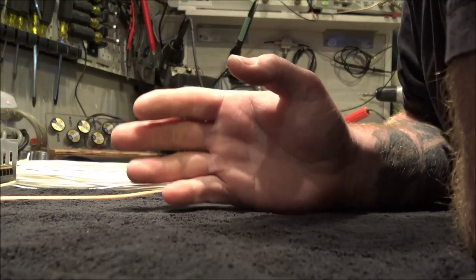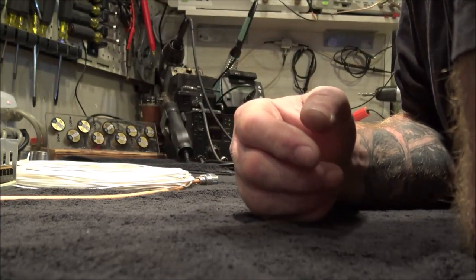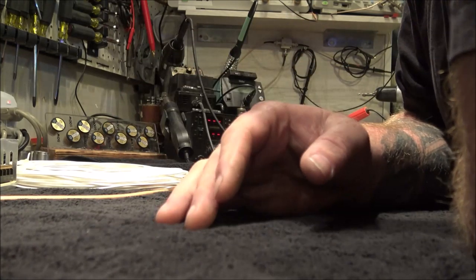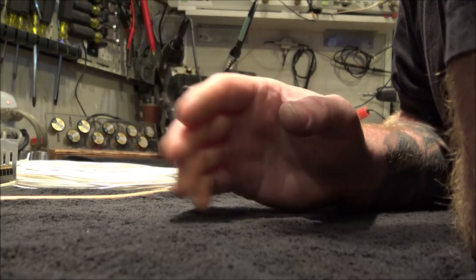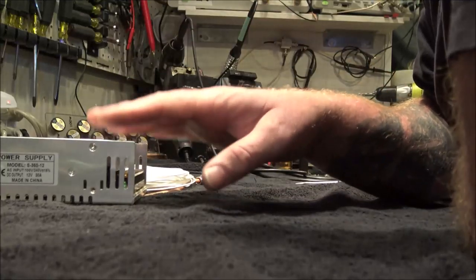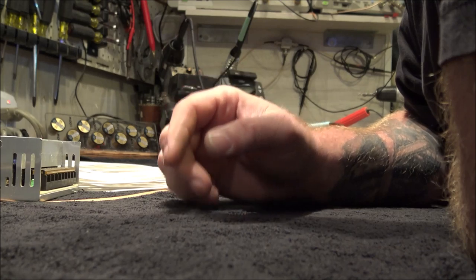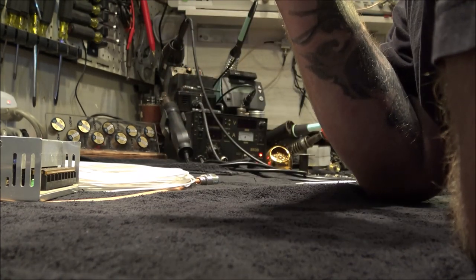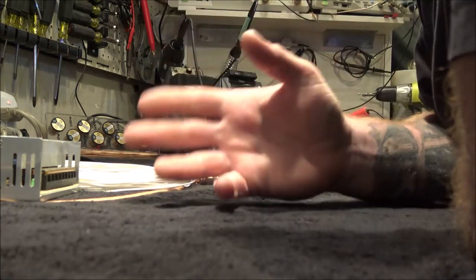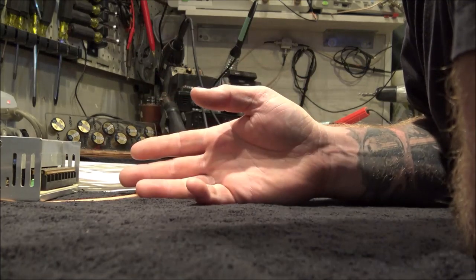I came across those 50 amp switchers probably 6-7 years ago myself. I had one gentleman that was all about me using these modules, and I put the modules in the unit. They're a little bit more spendy than the 30 amp ones, but the 30 amp ones seem to hold up with the way we use them, heavy surge load operation. I put the units in the amp, ran it, didn't have any problems, sent it to him. Within about a week or two, he ended up having module failures on several of the modules. They came back, I replaced them, then had more failures while I was here. I finally ended up going back to doing an iron core supply because it was reliable and I had faith in it.